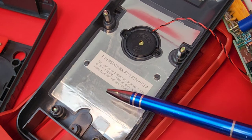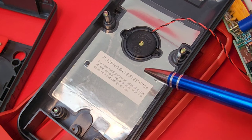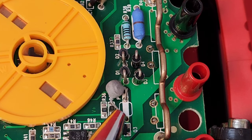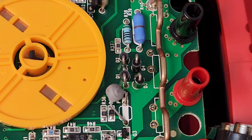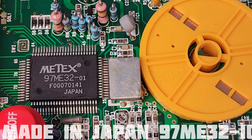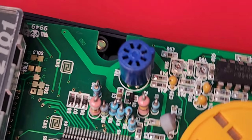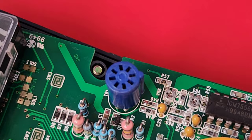Reverse side of the meter — look at that shielding, gorgeous throughout the whole length of the meter. Just a nice insert here for the buzzer or piezo. 250 volt, 0.8 amp, 800 milliamp fuse. That is a massive current shunt with lots of notches. We've got not one but two PTCs in total on the main board, and those inserts for the soldering jacks are very nicely done. Look at that huge yellow selector switch. The main IC is of course Metex 97ME32, made in Japan — even though this is a Korean multimeter made in Korea.